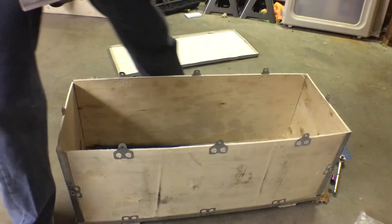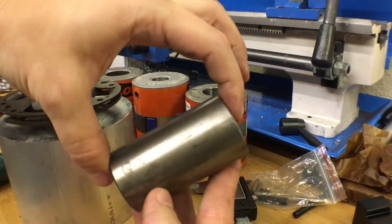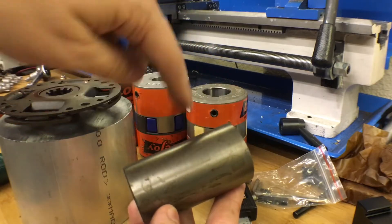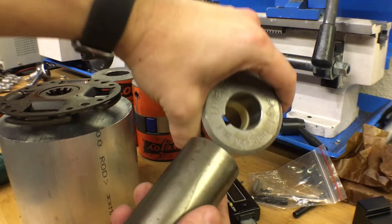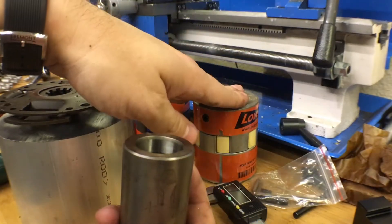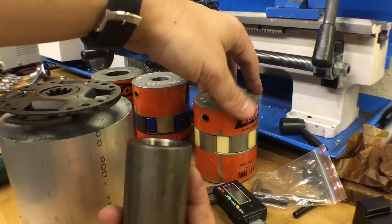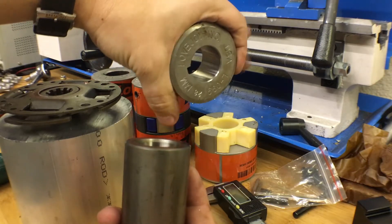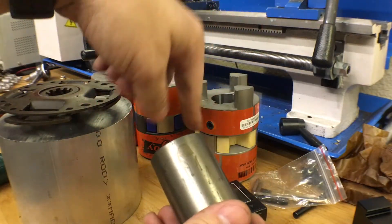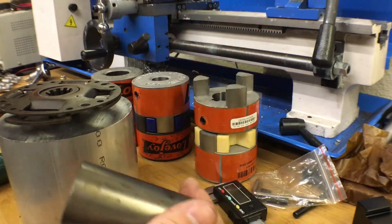The lathe might be needed regardless because measuring between the motor and the transmission, this coupler as it comes is too long and I may need to cut it down. I thought the best approach was to cut it on the lathe. I was also expecting to have to bore one of these Lovejoy hubs out — I could just purchase one matching the outer diameter, but that would be more expensive than the $25 I spent on all of these. So my plan is to throw one of these on the lathe, expand the inner diameter until it slides right in, and then use a friction fit with heat, a set screw, or maybe some tack welds.